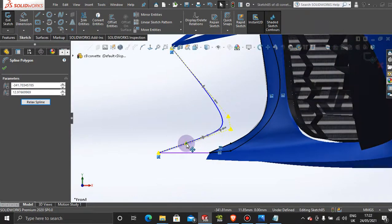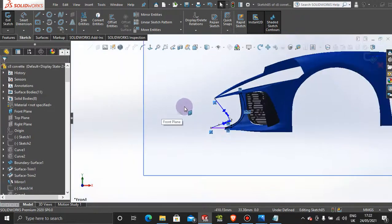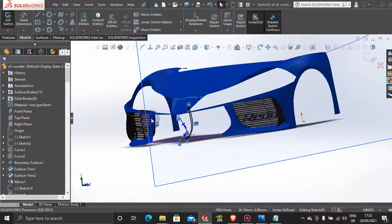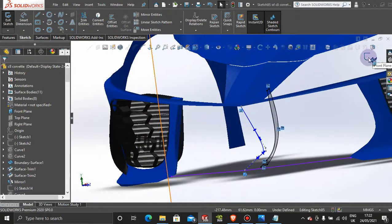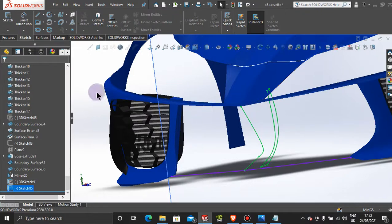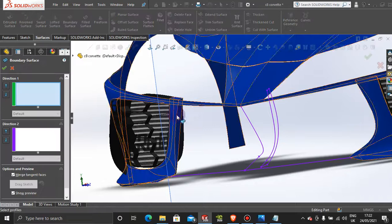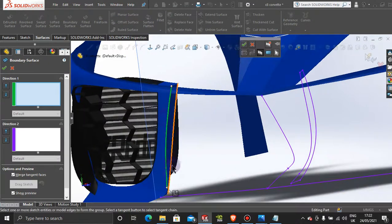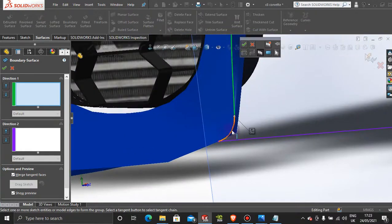So yeah, we can edit this surface later. So, get your line into this direction. And then we can cut out whatever we've got out. So, press OK on that. And that looks good. Okay, so exit the sketch, and then let's add a boundary surface, and then let's select manager, and then select this edge, and this one here,